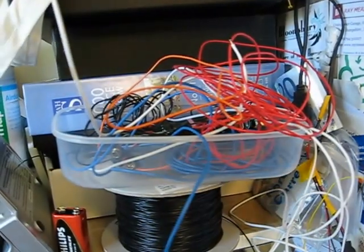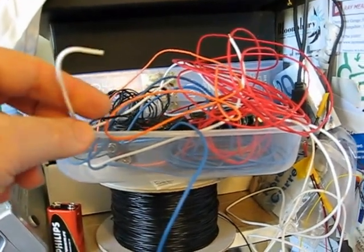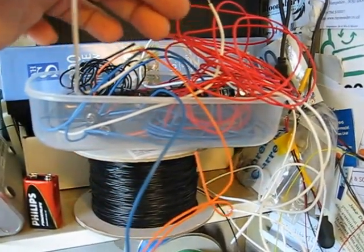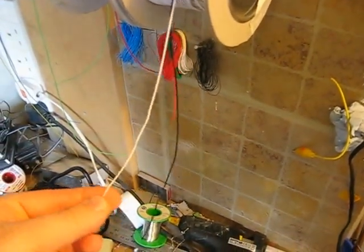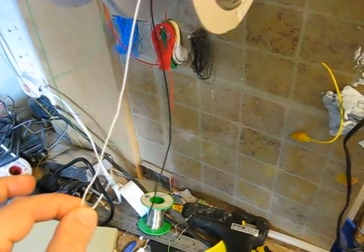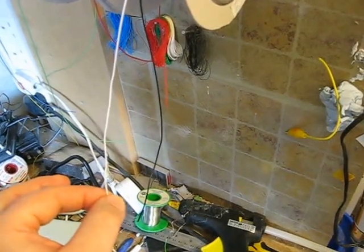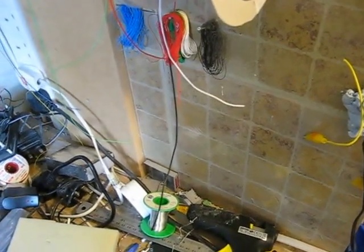For wiring, use 3 amp or 6 amp household cable for anything to do with power — connecting batteries on the negative and positive lines. It's a good idea to use different colours, especially if using different voltages. You need very flexible wire for things like cart relocation. However, this type of wire is only good for up to about 6 or 8 inches before you get too much interference on the lines and games stop loading or controllers stop working properly. If you want to go longer than that, it's best to use the wires from your controllers because those are shielded.